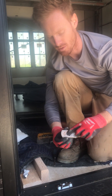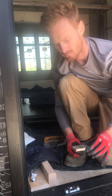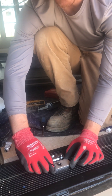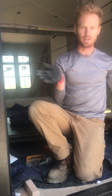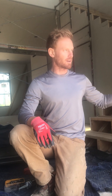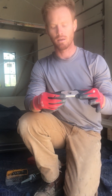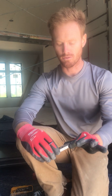It's got a cover on it, so this is what the door pivot point actually goes into. This has four set screws on it that allow you to change its position relative to the door slab, and that allows you to adjust how fast it opens and closes — kind of where it sits, like at 90 degrees, or does it stop at 10 degrees and allow you to push it the rest of the way. These four set screws absolutely need to be very tight.